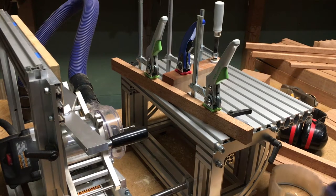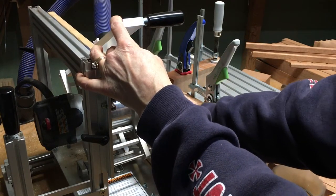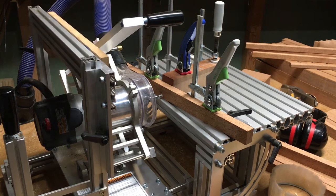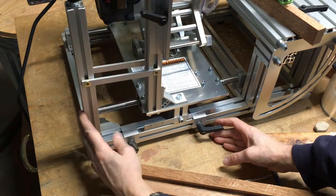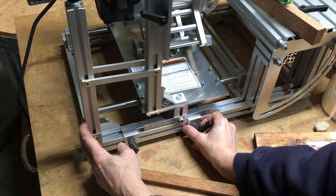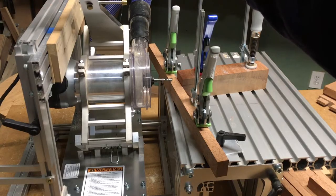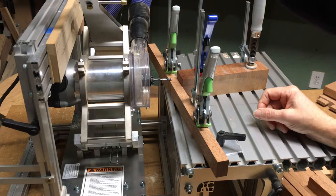I'll be doing the outside first. Up here it says the four millimeter follower, just as a reminder, so that's the angled one. The inset on the shallower part needs to be an eighth of an inch, and I'll be adjusting that by bringing the pantorouter up to the board on top. Then I can adjust and say I need that to go in one eighth of an inch. This measurement should stay consistent for all the boards because they're all the same thickness. Set that at one eighth of an inch — that'll give me an eighth of an inch inset.